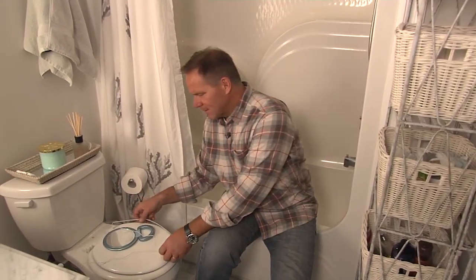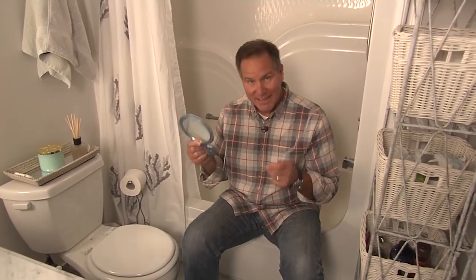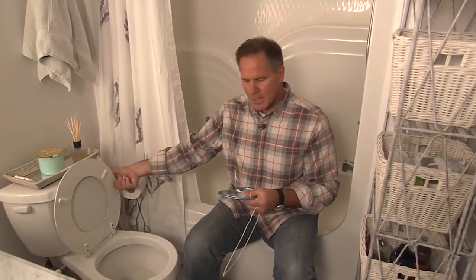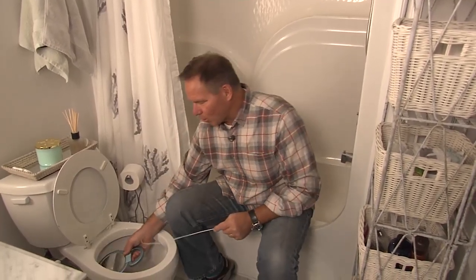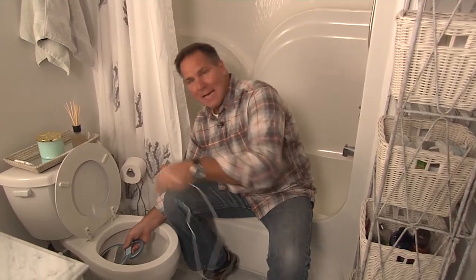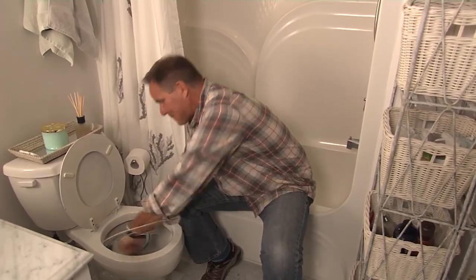There are plenty of times in your life where you're going to have to hire a professional plumber to come to your home, but I actually learned this trick from a professional plumber. A lot of times people have toilets and they say they don't flush properly. What happens is plumbers come out to your home many times and bring a metal coat hanger and a mirror — and that's how they fix it. You can do the same thing. Open up your toilet, take that hanger apart so you've got a little hook on the end, and use the mirror so you can hold it under the rim to see the holes. There's a series of holes under the rim that help create the flushing action. Take the hook and go in that hole and scrape it like a dentist does — really move it around — then go to the next hole and the next hole, keep scraping them out. When you do that, you flush the toilet and it works like a champ.